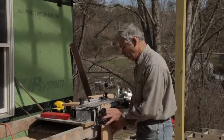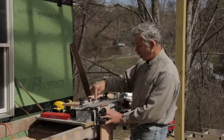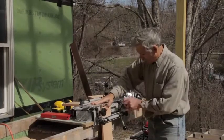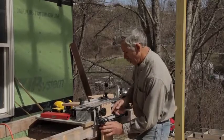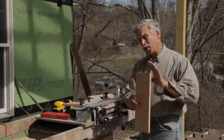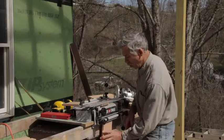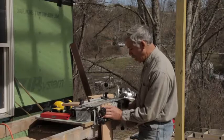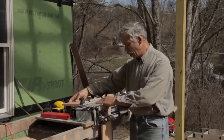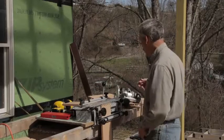If you want it in the front, it comes up like this. It's critical to clamp your receiving piece up here, then you can push down and tighten up your clamps so that gives you a height. The face right here — it's really critical for that to be touching the whole width along your template. Pull it in, pull it up to the top, pull it tightly, then you can pull this over and lock it. Loosen this, adjust your receiving piece so it's tight against the back, and then you're basically set up to get your router.